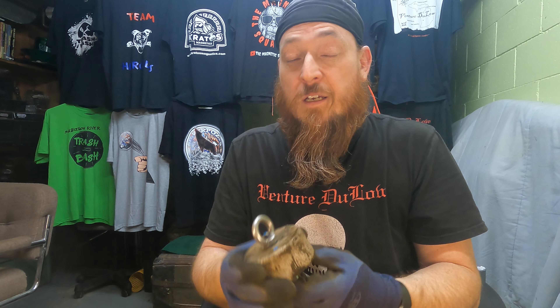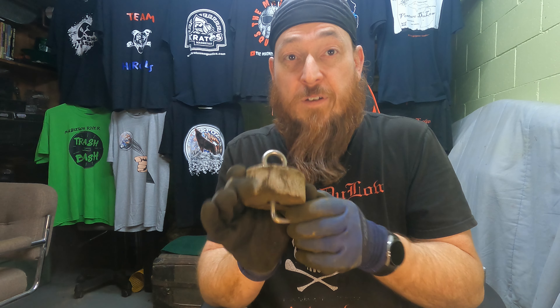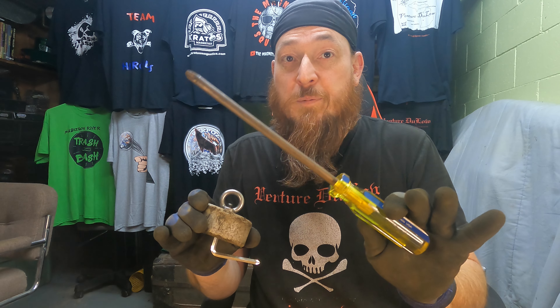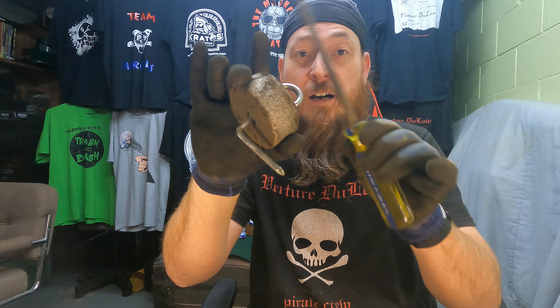Make sure you've got gloves on, and one more step — you can wear safety glasses. Because anything comes flying off this or something smacks into it, it can cause sparks and cause debris to fly off it. Always better to be safe than sorry. Also, any steel tool — you've got to remember it will stick to the magnet. Myself, I use bronze aluminum tools. They're a little more on the pricey side, but they will not stick to the magnet — they fall off.